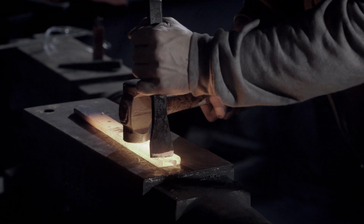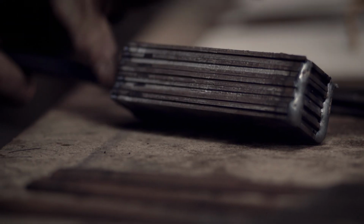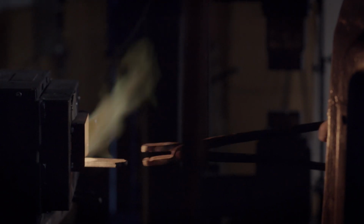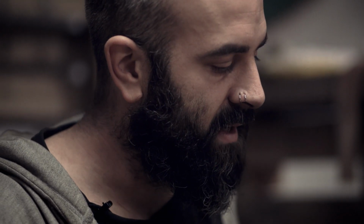And then I cut it and clean it all up with an angle grinder, and then restack it, retack it, and once that forging process is done, I end up with one piece of steel with 48 alternating layers in it. Once I've got to that stage, I put a core in. So this is when the 01 tool steel comes back in again.